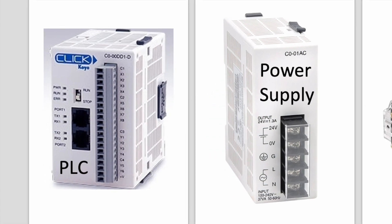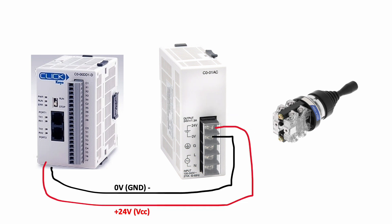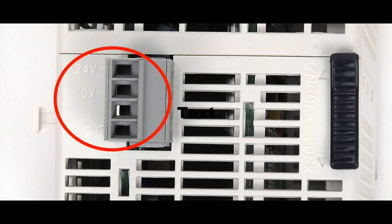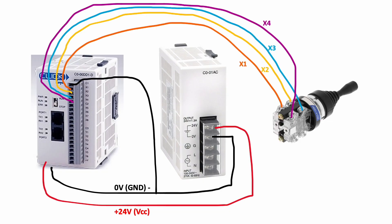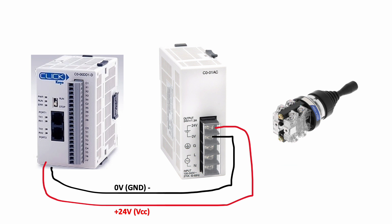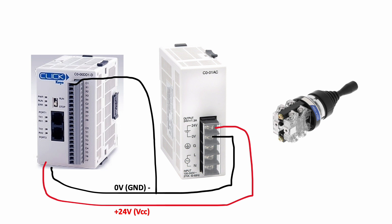Let's say that you have a PLC controller, a power supply, and an automation joystick. How do you wire these together? Well, first you connect the zero volt — also known as ground or negative — from the power supply to the CLICK PLC negative terminal, as shown in black here, and the 24 volt positive VCC from the power supply to the CLICK PLC positive terminal, as shown in red. For this CLICK PLC, the negative and positive power inputs are on the bottom side, or in some cases the power supply can be latched directly to the CLICK PLC on the side to make these connections. These remaining four screw connections must be wired together into a branch and connected to the 24 volt positive VCC power line of the power supply. Lastly, connect a wire between the common or C1 screw terminal on the PLC and attach it to the negative zero volt ground line as shown here.